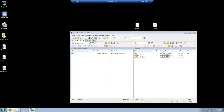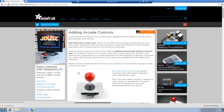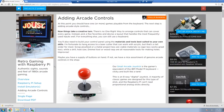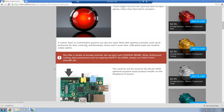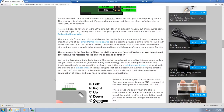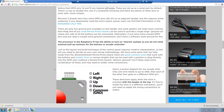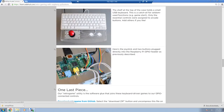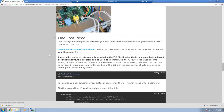Our Pi doesn't know that we have controls wired to the GPIO, so I'm going to follow this guide right here, which I'll have linked in the description as well. We're going to download a file and modify it. Let me scroll down to where the file is. This just talks about hooking up one of their products to do all this, which we're not going to do exactly. There's a section here. Here we go.